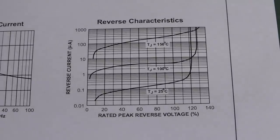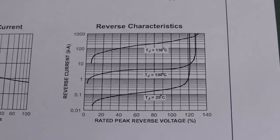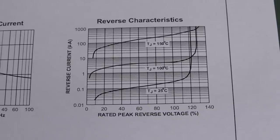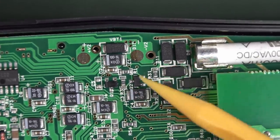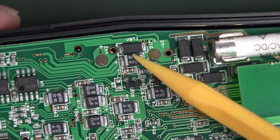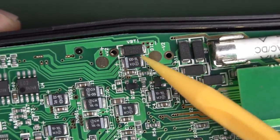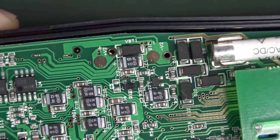If you see this sort of excess power consumption in a product, I would look at that diode. You should be able to measure it with an ordinary multimeter — you shouldn't need a microcurrent meter or a fancy six-and-a-half digit meter. If it's in the order of microamps, don't worry about it. If you've got significant battery drain, it's going to be in the order of hundreds of microamps or more. Also look at potential contamination — moisture on the board, or if you've spilled something through the battery compartment. Give it a good clean with isopropyl alcohol and a good dry out.